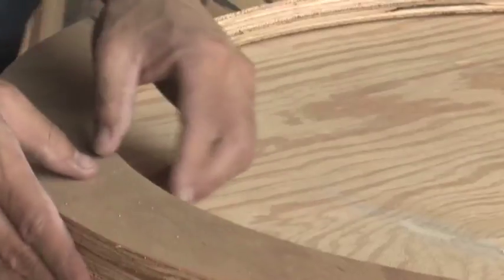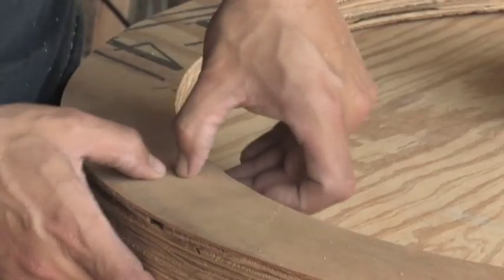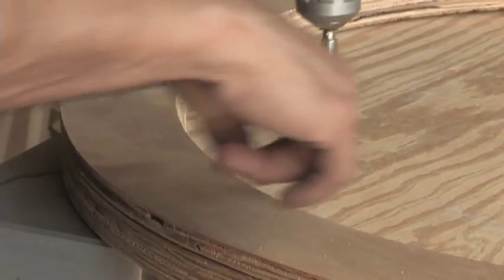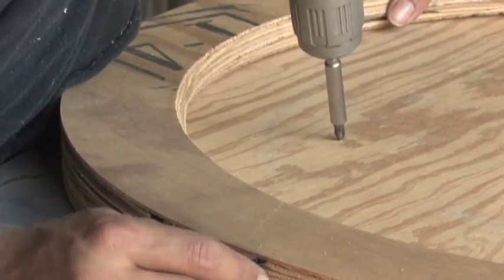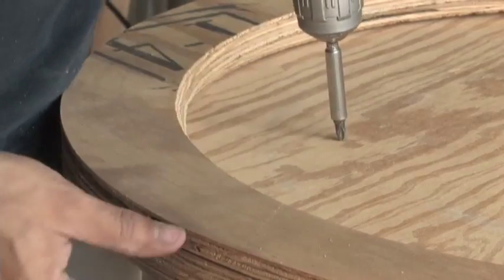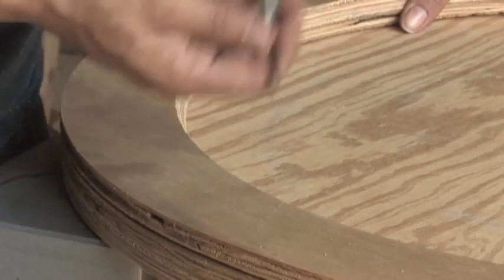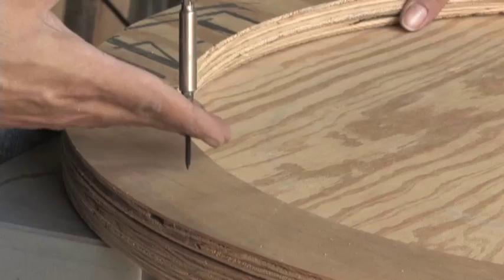Okay, and then we are going to put in our wood screw, about 1.5 inches, because the blade depth is not going to go like that. Now, this is a trick. The proper way to do it would be to pre-drill. The screw is going to go right down and stop just short. These are actually 1 1/4 inch screws. You don't want to come out the other side because you'll have a sharp piece. You can pre-drill this so you don't split the wood. There's a little trick with fine drywall screws only. It only works with those: going in reverse.